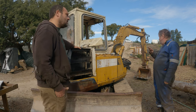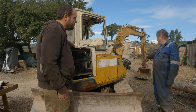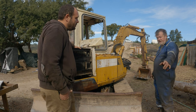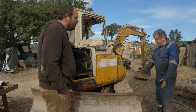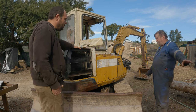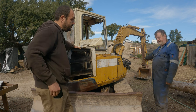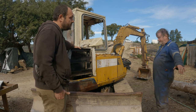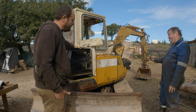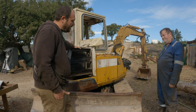On very soft ground, always have the blade in the direction you're heading — so you reverse in. The reason is: if you reverse in and your tracks are sinking, you can ease the front of the machine up a little with the bucket, keep the blade up at the front, and get yourself out. If you do it the other way — blade at the back as you're traveling — and you start to sink, lifting the front may cause the blade end to sink further and you can't lift the blade high enough to help. So always reverse into anything that's going to be wet or suspect.